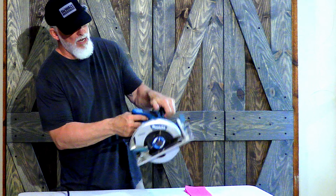I hear a lot of guys say magnesium is there to make everything slide better — they put it into the plate that you run across your material. Well, that may be true to a point, but the big thing with the magnesium is they've actually spread it out into the components throughout the saw, which helps distribute weight, makes it less fatiguing, really durable and strong, and it just balances the whole unit. That's what your magnesium is for.